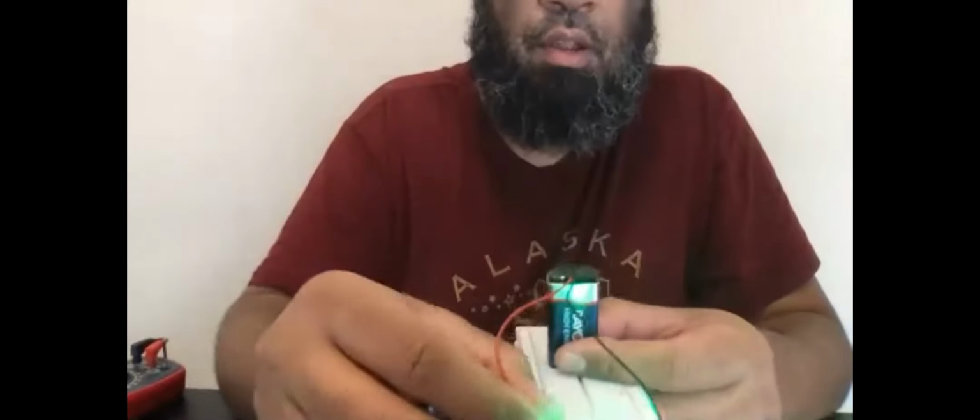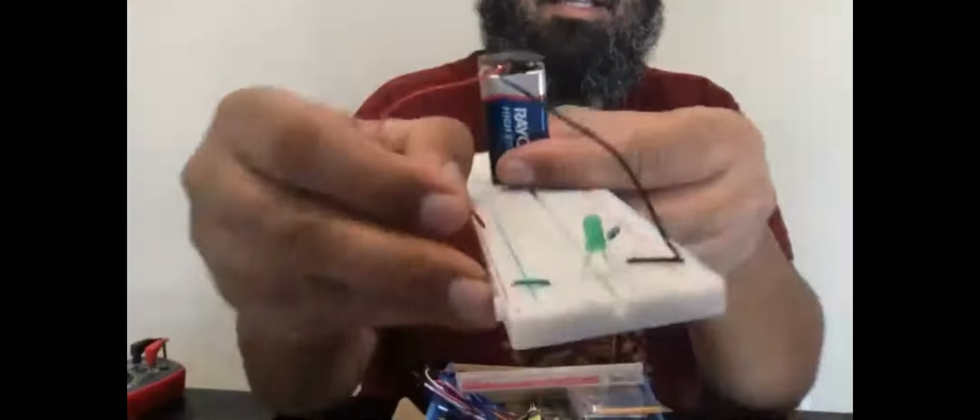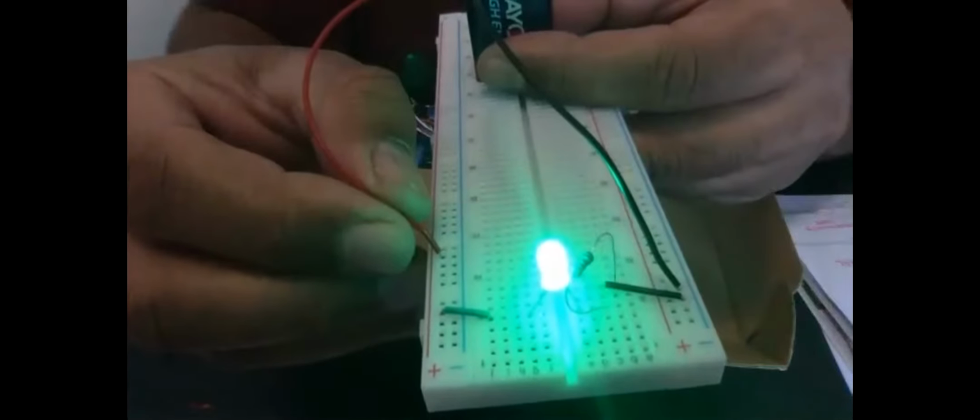All right, so I guess I covered everything I wanted to show you today. Questions? Now, I'm not saying I've shown you everything, but I've shown you enough to feel comfortable building a simple thing with a breadboard. So what I've done here is just used a simple concept where I can now, on that bus, go anywhere, bring my wire in, and I can turn an LED on. You can fill this whole thing with LEDs and have this whole thing light up.